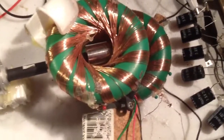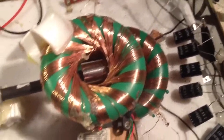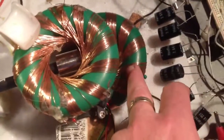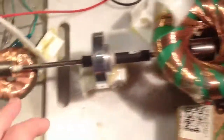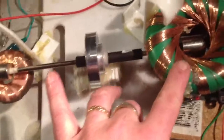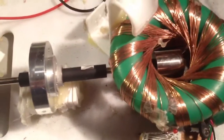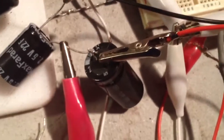If you can bear with me, I'll just bring you an update on this contraption. We've still got our permanent magnet here and a permanent magnet up the other end. We've got the drive rodin coil here, this is a pickup rodin coil, and this is another pickup rodin coil. These two coils are on separate Schottky diode bridge rectifiers, and then we're putting that charge into a cap over here. This is just a test cap — it's not the one I'm going to be using for the final motor.